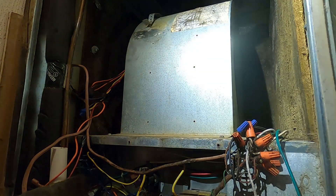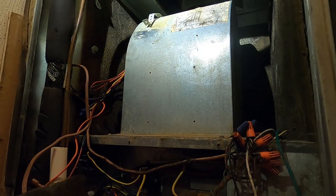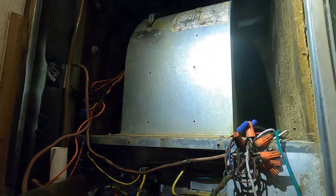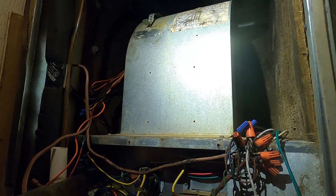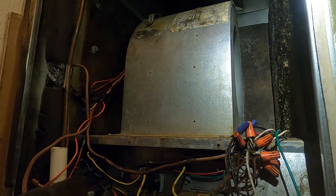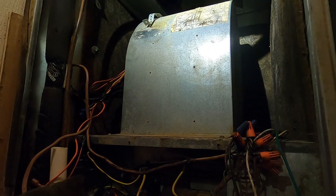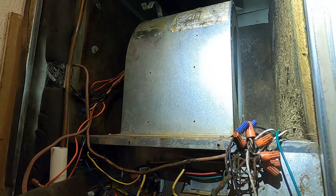It's not something you have to do every year like doing your coils and your drain lines, things like that. But every so many years it's probably not a bad idea to have somebody pay a little extra to get the blower wheel cleaned. And that does cost extra because it's more work. This isn't something you're going to do in an hour or hour-and-15-minute general heating and cooling service. It adds about another 20 to 25 minutes to the job, so we charge extra for a blower wheel pull and clean.